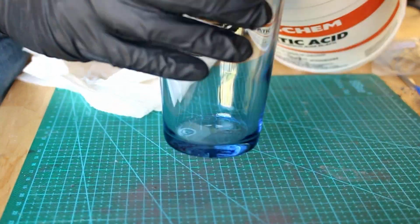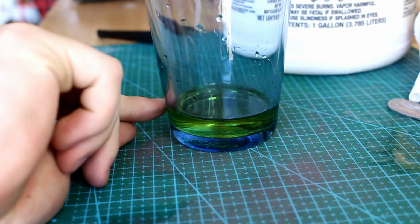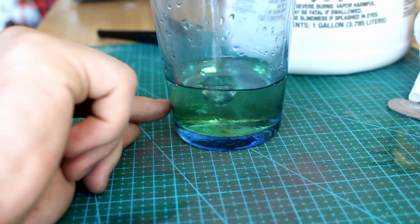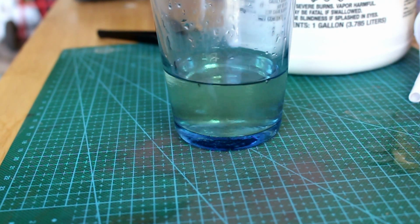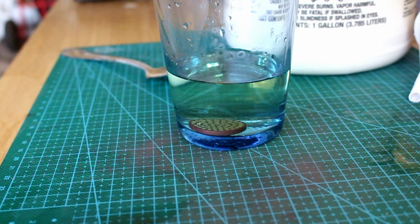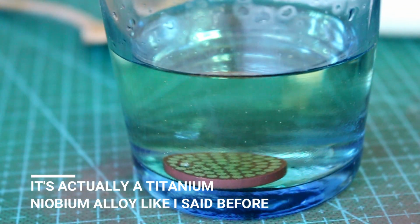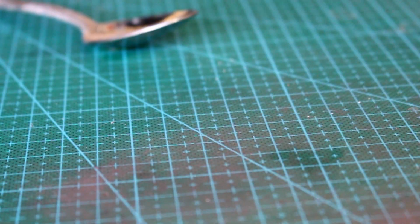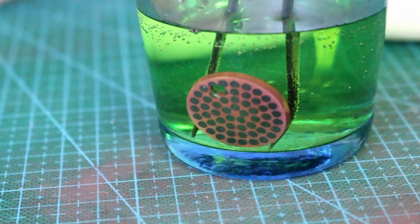So we're going to etch it now, and I didn't have a lot I needed to do before this step. When we've etched Damascus steel in previous videos, I've used straight muriatic acid. It's great for etching steel. But here I'm mixing 2 parts hydrogen peroxide to 1 part muriatic acid. That's because superconductor is made from titanium and copper. We want to dissolve the copper, but the acid won't etch copper on its own. So adding hydrogen peroxide allows it to oxidize and etch the copper in the superconductor.